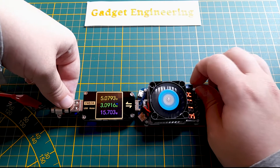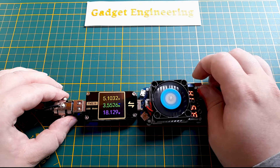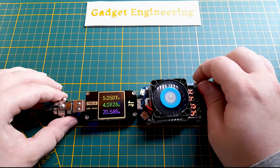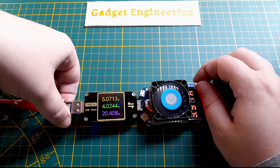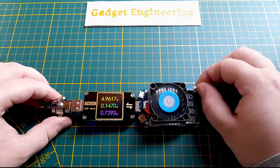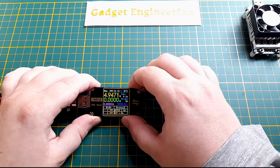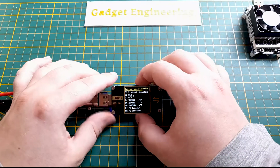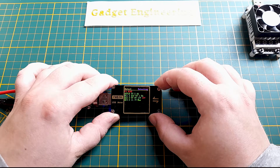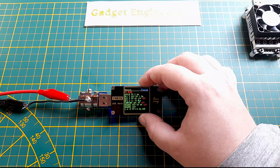At 3 amps it's getting quite hot now, but we can even exceed that rating — it seems to be doing fine and will obviously go into thermal control at some point. At 3.5 amps it's still doing fine, and we can go even higher. The voltage is coming up slightly but should still be in USB spec. Doing 4 amps now — doing fine at 5 volts. The chips are barely touchable. On the detection page of our USB tester, with the USB-A we see most quick charge settings — 5, 9, and 12 volts, no 20V — which is fine. No Power Delivery on USB-A, as expected.